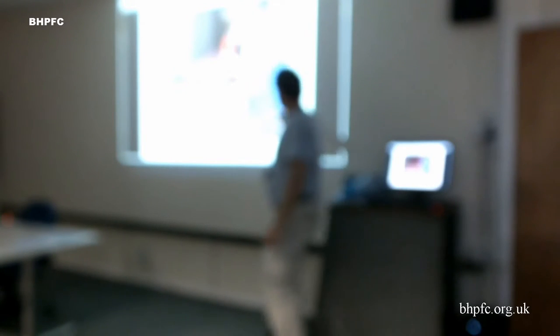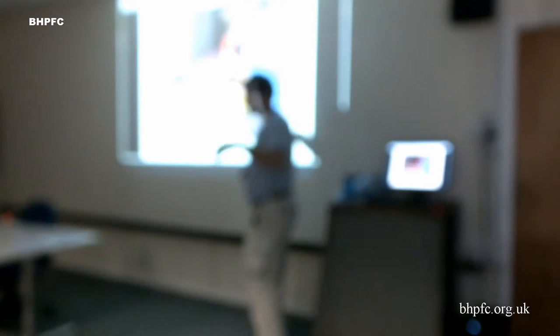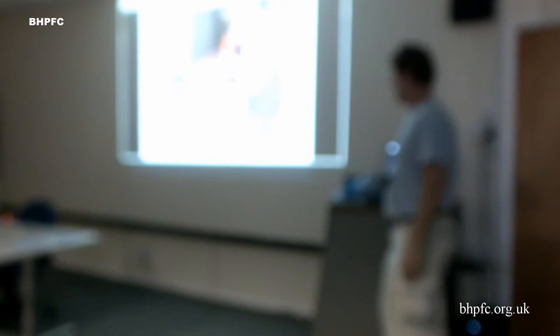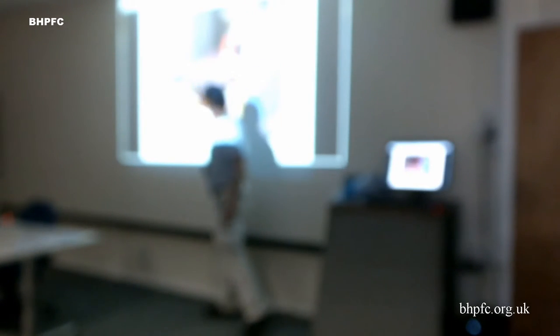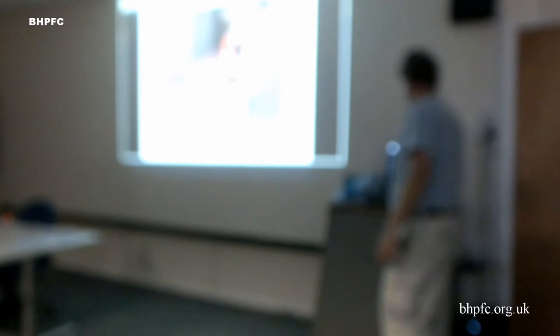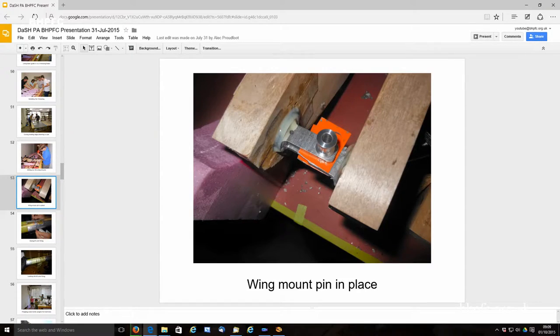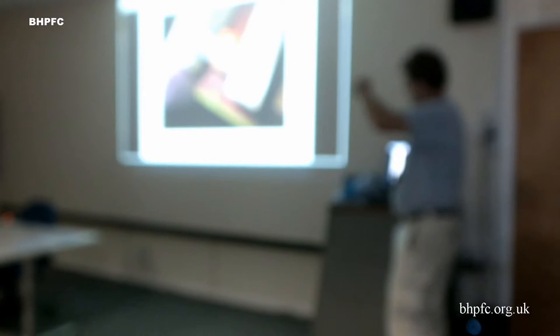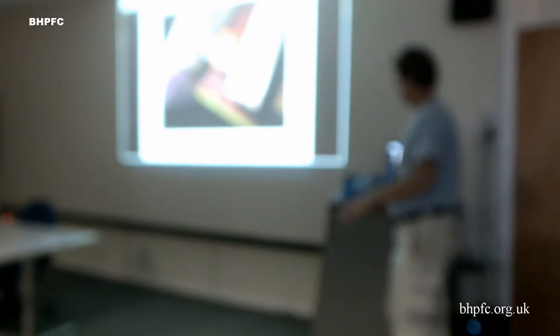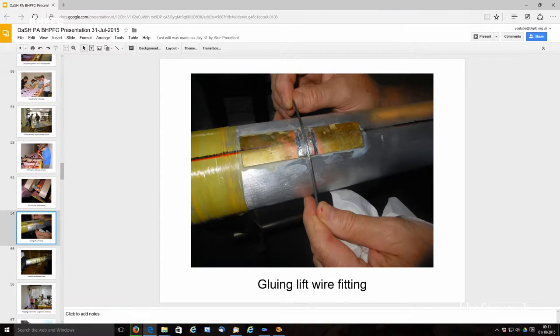We keep a gap between sections that we cover up with tape, and then we have two aluminum pieces, I may have a picture of it, that are used to prevent the wings from coming apart, but obviously most of the force is taken up. We've got sleeving inside here. It's about 2.5 diameters of the spar that's taking most of the load. And yeah, that's what it looks like. Those orange things are shims, but there's a little 7075 aluminum pin that goes into these other pieces, and those are glued into the rear spars and the front support pieces.